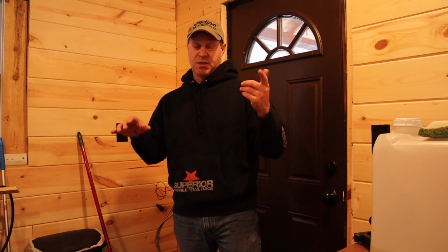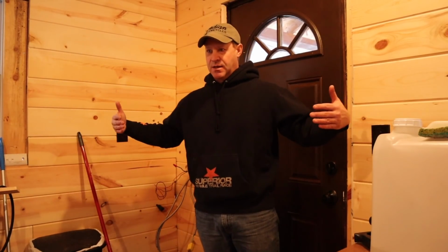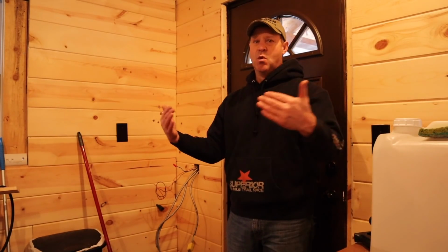You guys left me tons of good ideas. Probably the item that was most mentioned by people was putting some sort of X bracing in there. The second one was just running some lag bolts through the outside of the post. And then the third one, which I thought was pretty good, was running wires with eye bolts and using turnbuckles to tighten them up on each other in an X pattern. So I think I'm going to start with the least intrusive way first, and that is with some big long lag screws, and see if I can come in from the outside into that rail stud and tighten it up that way. If that doesn't work, I'm moving on to plan B, which is probably putting some more 2x4 bracing in there. So might as well get that started.